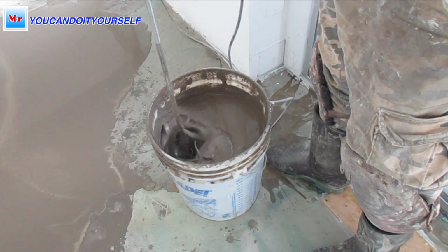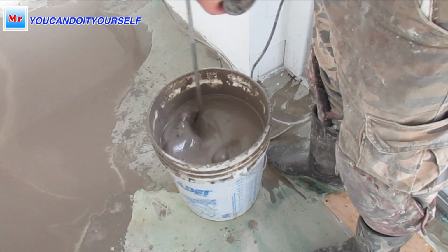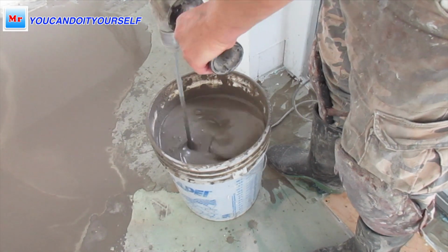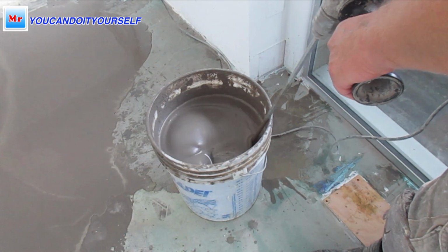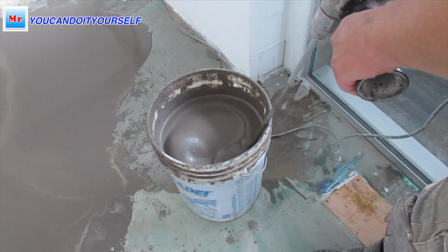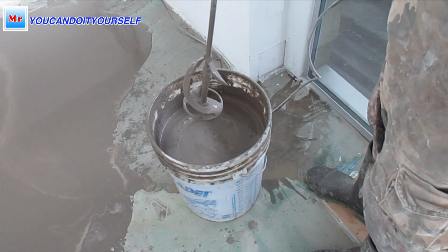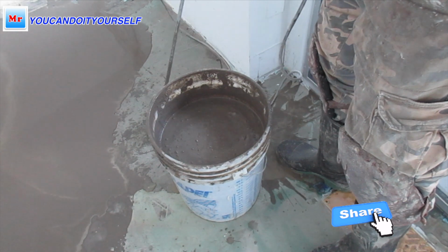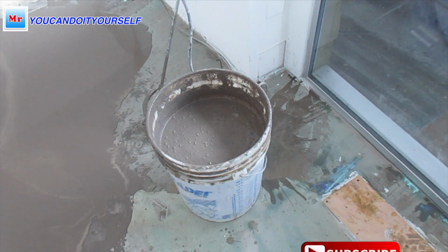Not only as in my videos, where I'm using Mapei and Mapei Primer. If you're using a different brand, you might think you don't have to use primer. No, for each self-leveling compound you have to use the primer which is recommended by that manufacturer, and it's really important for better bonding of this material.